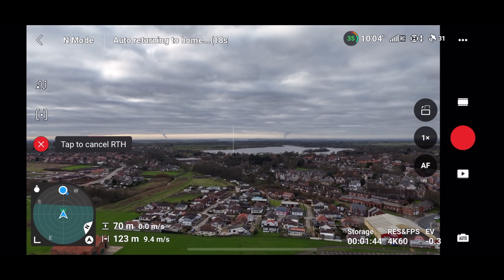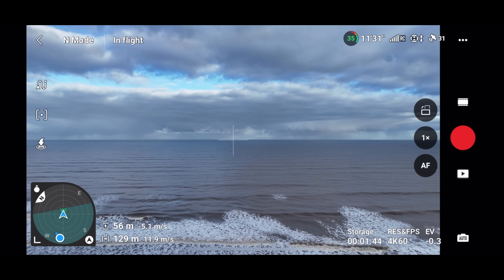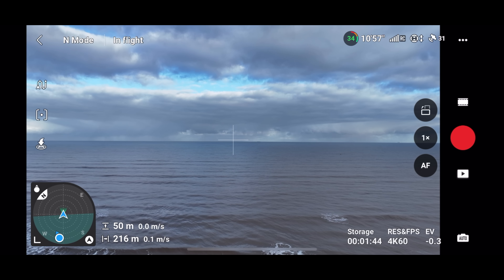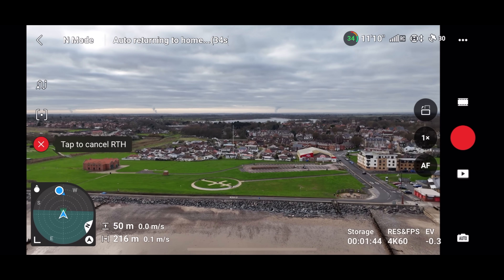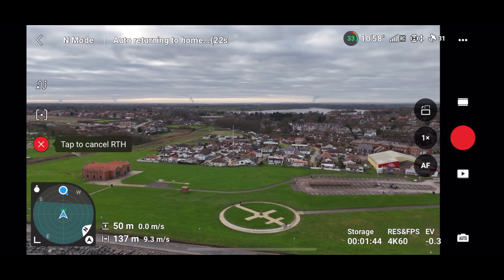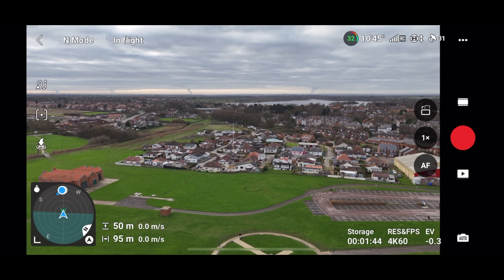I consider that successful. Let's cancel, spin it back round, bring the altitude back down to about 50 meters, fly back out, and this time go into the DJI Fly app settings and click it back to optimal, then hit return to home again. In optimal setting it should not rise using the preset altitude — and there we go, it's coming all the way back to the home point with absolutely no issues. That one is completely debunked: both return to home altitudes — optimal and preset — before and after the firmware update are working exactly as they should.